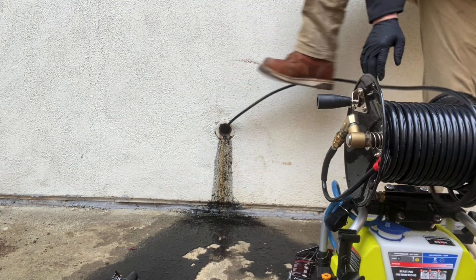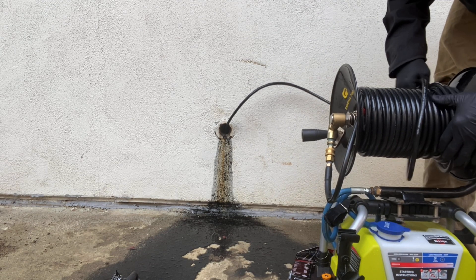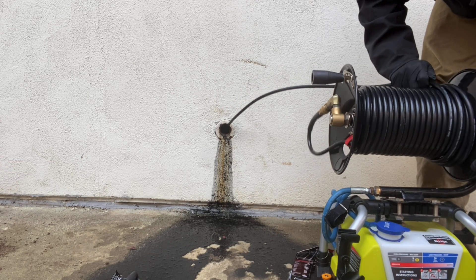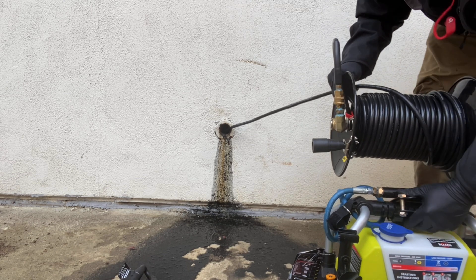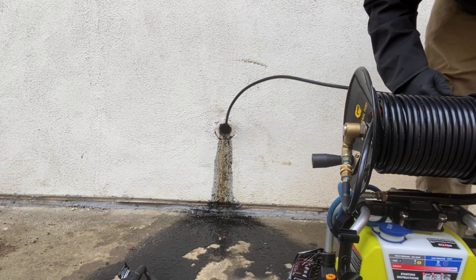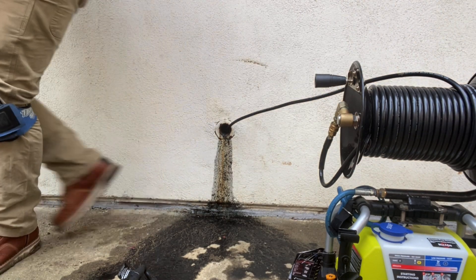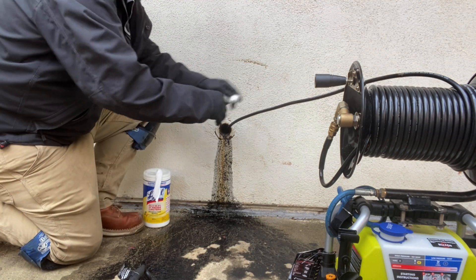This really saved my butt. It only cost me $150 for the pressure washer, and I think you can get a pressure washer to jetter conversion kit for around $100 on Amazon — that's actually what I have here right now. This isn't like a really great jetter hose but it'll get you by, it'll definitely get you out of a bind. As you can see, I unclogged this line with the black sludge of doom. What's really cool is after you unclog the line, if you make a mess like this, you can hook the pressure washer back up to the sprayer and spray all the concrete down — it'll look like you were never there.